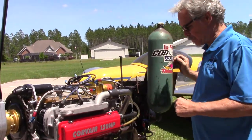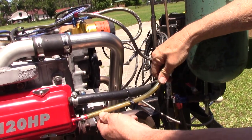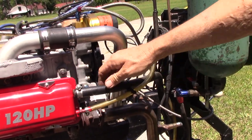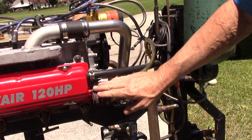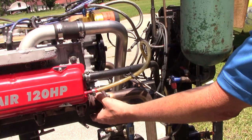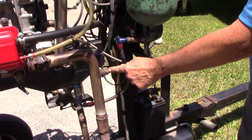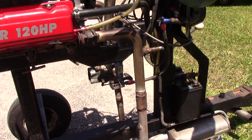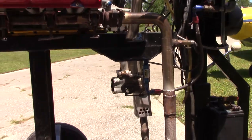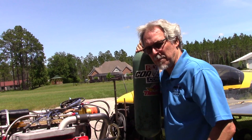Here is the test stand's instrumentation. This clear hose tells me the level of oil in the valve cover. We have separate information about making sure your push rod is centered in the lifter — this hose tells me whether or not that was done. The regular vent line is here. Below is a cast iron exhaust log from a car — not a flight system. This system leads to the air-fuel meter on the stand. Down below is our traditional MA3 SPA carburetor, specifically the 10-4894, which is a Cessna 150 carburetor — our main unit used for years on these engines.